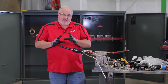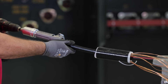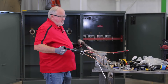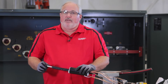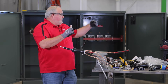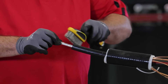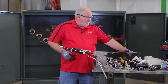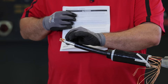Next, we have to expose two and one-eighth inches of the conductor. Now our conductor is exposed — this is where our connectors go. We need to crimp our connector on. Make sure you're facing your bushing — you want the flat part of your connector where the probe is going to be facing the bushing insert. Always wire brush your cable to remove the oxidation. Always keep the inhibitor inside the connector — do not take it out. The elbow kits have a crimp chart that comes with the instruction sheet. Make sure you have the right crimp tool, the right die, and that you crimp the correct number of times.